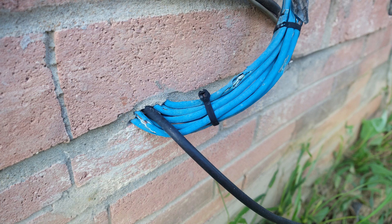It causes problems — water gets into the cable. And once the inner conductors are exposed, as you can see, some of them have even been discolored. Once they're exposed, their insulation is going to start disintegrating also. You should never, ever run inside wire outside.